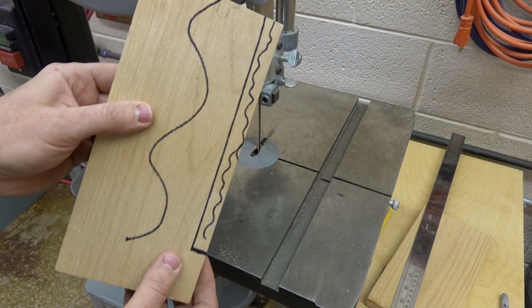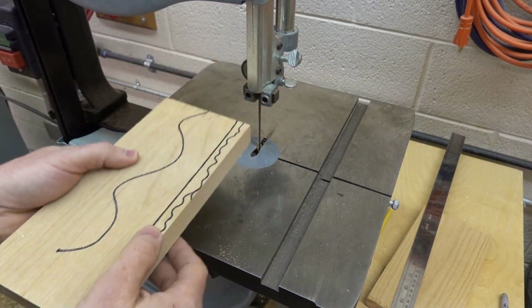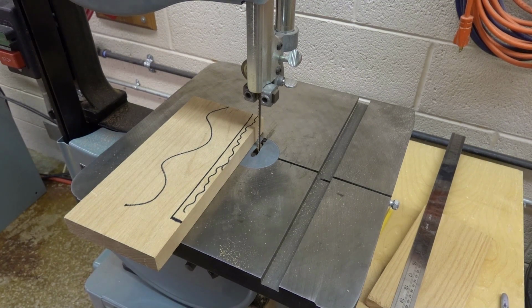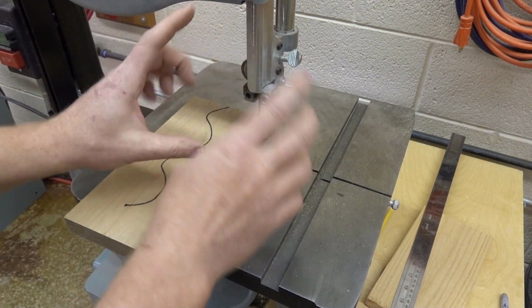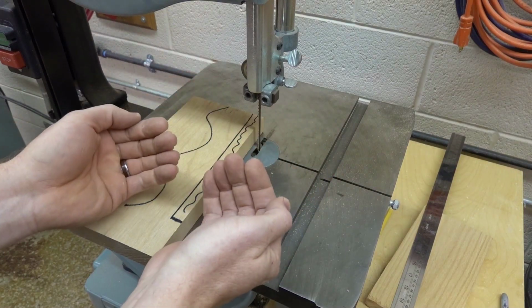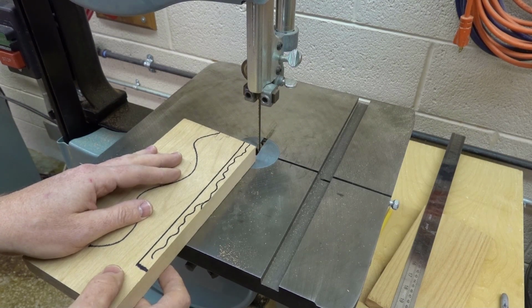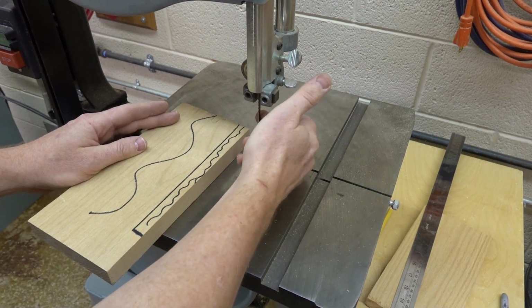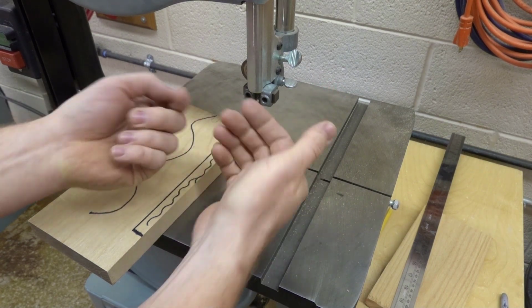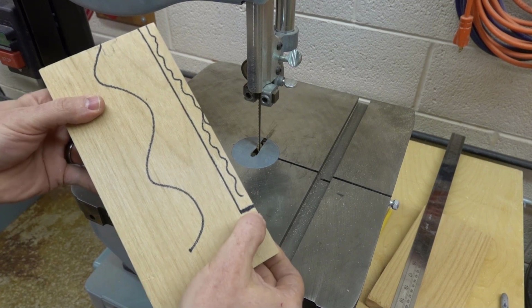Second, on a cut like this, which one of these two do you make first? Now, I said before that the blade is only high-centered into the machine. So the blade is running around on a high-centered wheel. It's very easy to pull that blade off. So by pulling out a board, making a cut, and then having to pull it back out, you're putting tension and pressure on the blade to come off the wheel. So between the two, you always want to make the short cut first.